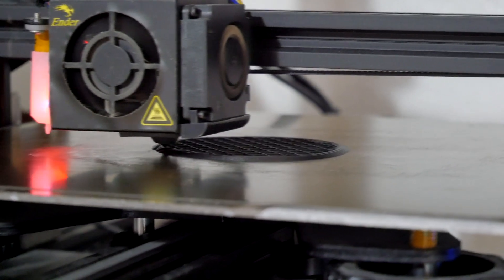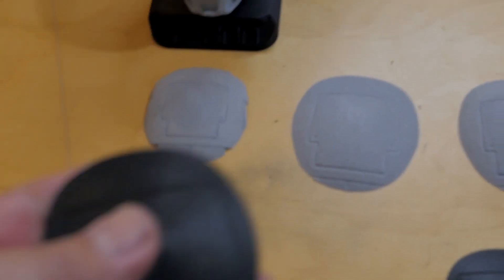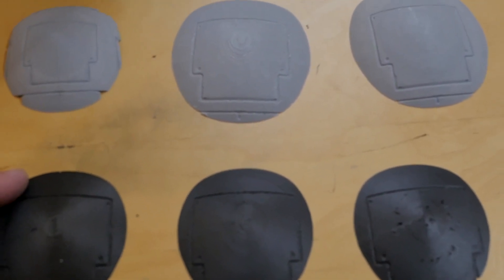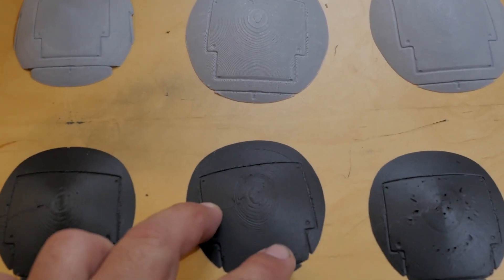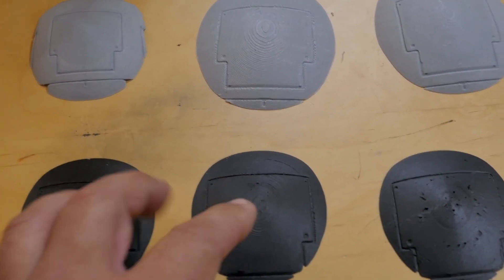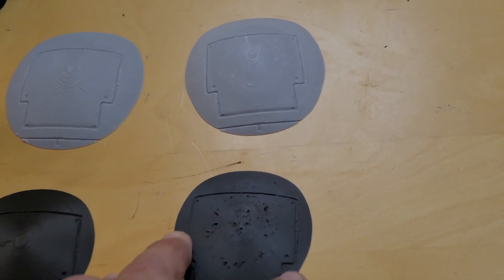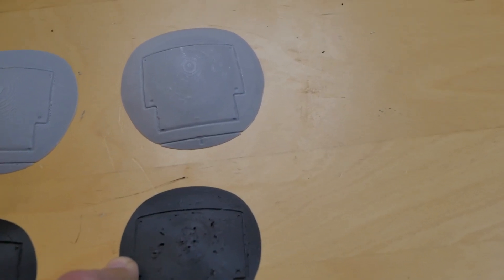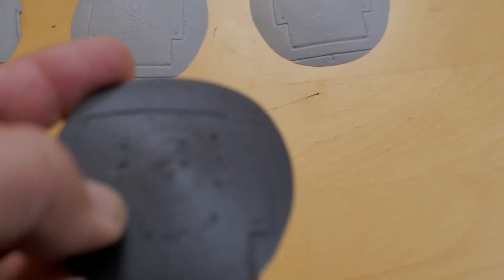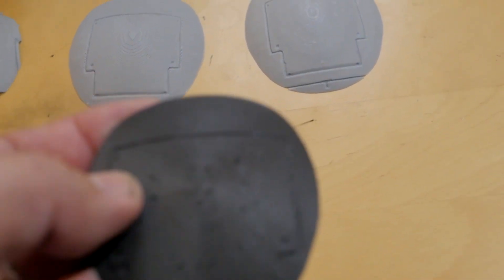You can see I tried adaptive layers on this sample — it's questionable. It looks a little different and I think it does better on the outer edges, but up at the peak you can still see the rings. This next one I reduced the layer to 0.12mm and used adaptive layers, and it looks like that was doing the trick for rings, but there are some little artifacts.